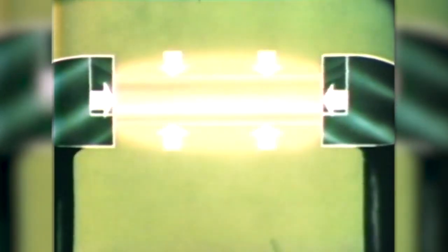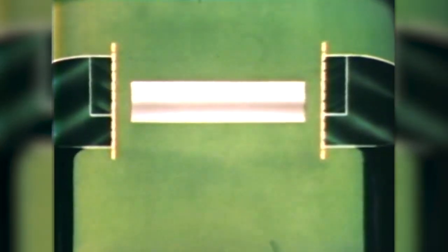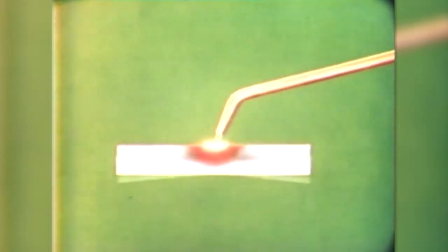As the bar cools, it contracts evenly in all directions. The result is a shorter bar with a greater thickness. Now, let's go back to our original bar and see what happens when we heat only one side. Getting up close, we see that expansion in this case is localized and uneven. The surrounding cool metal acts similar to the vice and restrains expansion in these directions. But there is no resistance to expansion in this direction. This uneven expansion causes an unnatural displacement of metal. When this area starts to cool and contract, a small amount of that displacement becomes permanent. In other words, there was no control, and the final result is distortion.